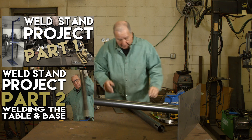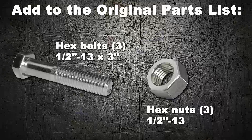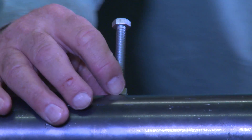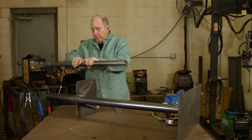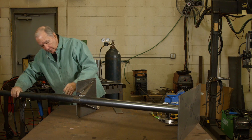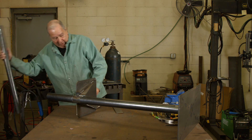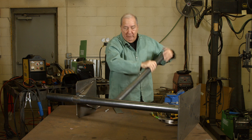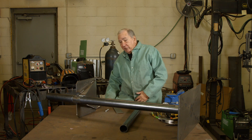The last thing I'm going to do in this episode: I'm going to tack weld a nut over this hole that I had previously drilled, and then this will be a fitting that you can tighten this nut down, and that will hold in place the tube that's going to slide in and out to give us extension. Also after I do that, on this tube we've previously cut the slots — we're going to install the arm, and then on the end of the arm we're going to install a clamp, and once that's finished, the project is finished. So let's get started and we'll get through this in pretty short order.